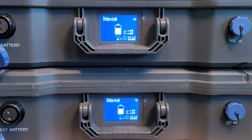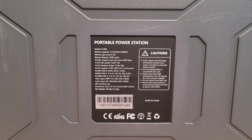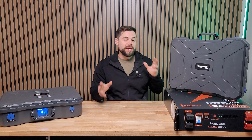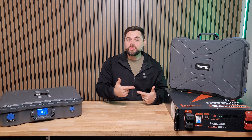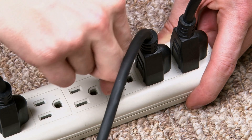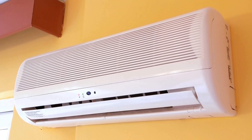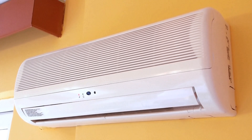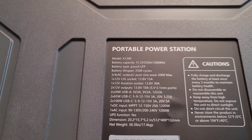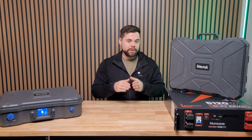It'll surge up to 4,000 watts, and when you join two of them together, everything doubles across the board. You can basically get up to 5,000 watts of output — maybe 4,800 to be safe — even though it's only rated to 4,000. That also means you can surge up to 8,000 watts, which makes it very easy to run a well pump and some small air conditioners. You could run a mini split that's probably 24,000 BTUs or less, but an electric dryer, electric water heater, a range, or an oven are going to use more power than what these two units together can run.